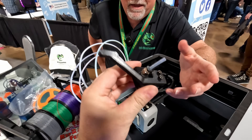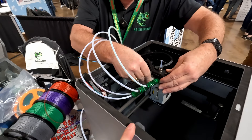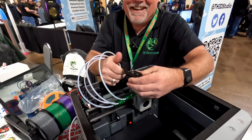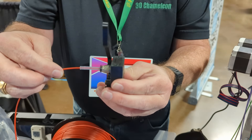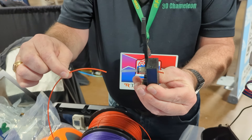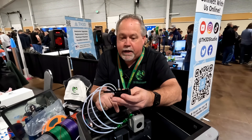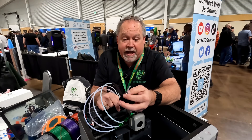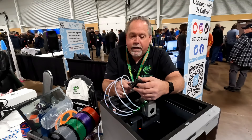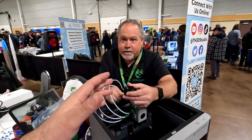The 3D Clippy is mechanically actuated — you move the hot end over to the side, it cuts the filament, then moves back to reset. This gives the same reliability improvement Bambu achieved. Designs are published for the Sovol SV06, Creality Ender series, Prusa, and Prusa Mini. If you want to get into multi-material printing cheaply, you can get an SV06, install the Clippy, and you're ready to go.